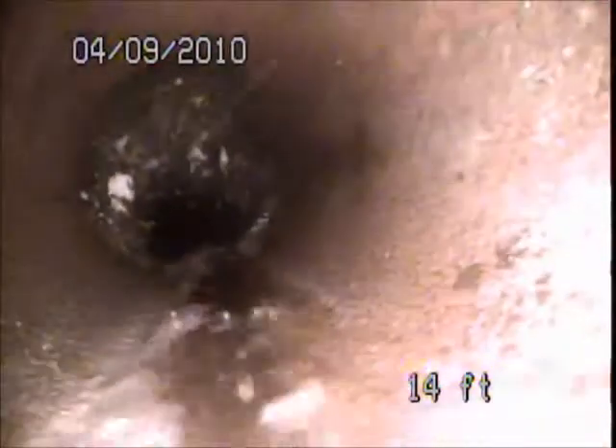Right here, we are exiting the newer plastic and entering into what appears to be original vitrified clay. We have a couple of trees in the front yard — one in particular that has a rather aggressive root system. Vitrified clay is also a good material because, like plastic, it does not rust or corrode. Where it differs quite a bit from plastic is that it is one of the more susceptible pipes to seismic damage. Even more commonly an issue, clay is one of only a couple of materials that will actually allow roots to intrude through the joints of the piping, which we saw some of a moment ago.